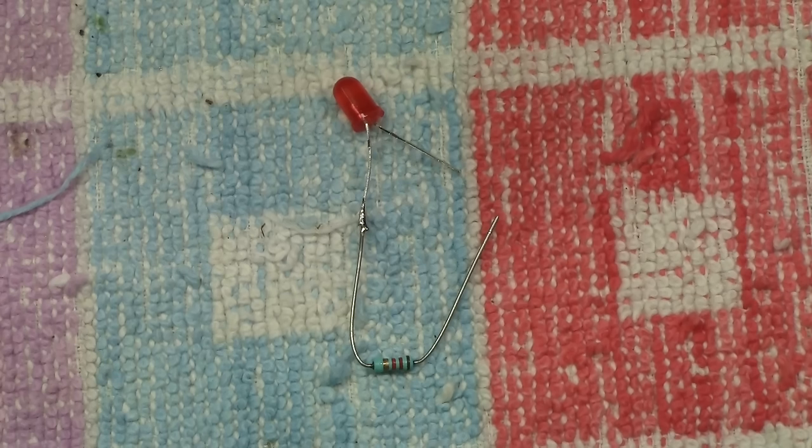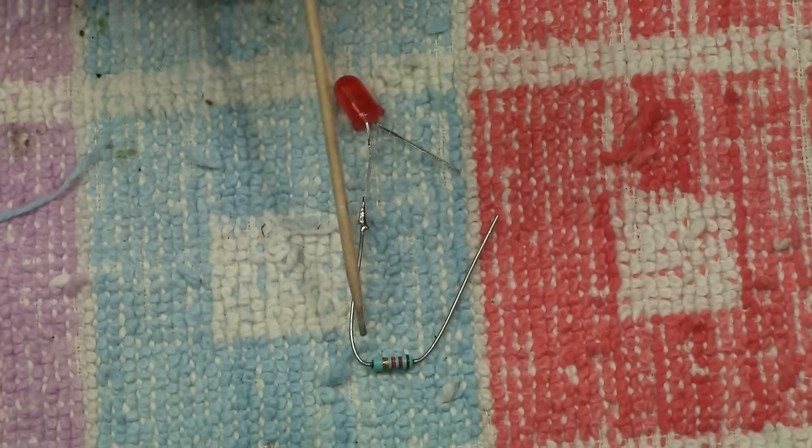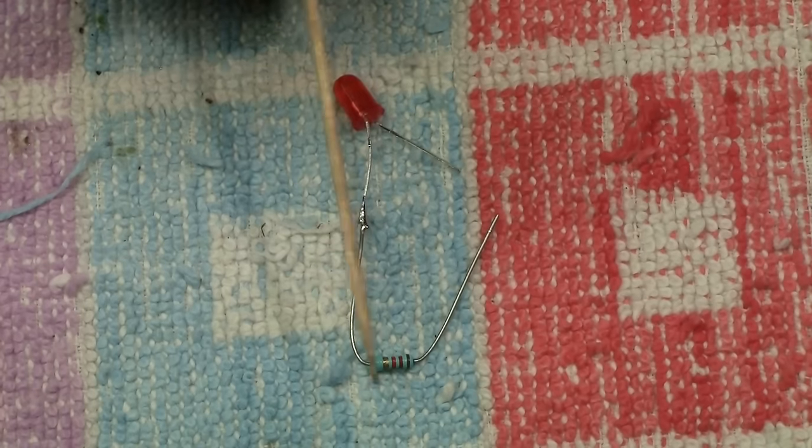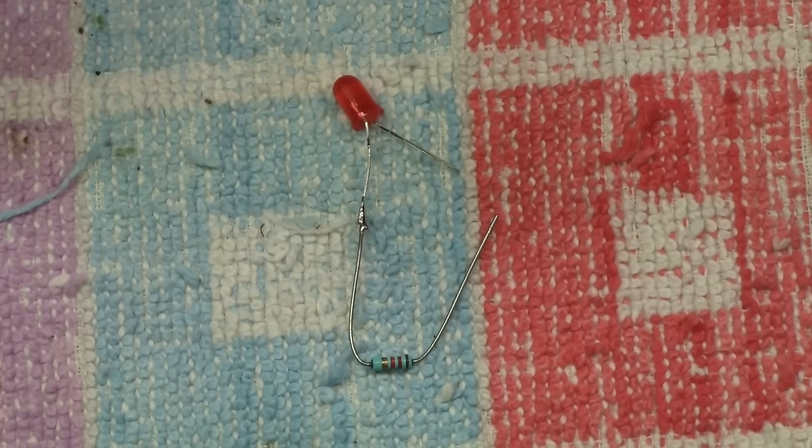I will put a link about this in the description box of how you can get to the calculator to tell you what to choose that resistor to be. In this case, with the LEDs I'm using, it's a 1.2K, which in electronic terms means 1200 ohms or a 1K2. It's all the same.